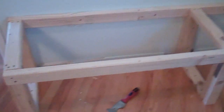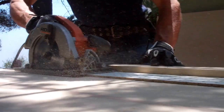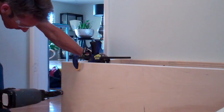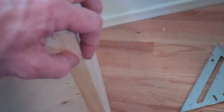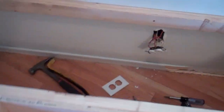Now I just have to cut the plywood skin that's going to go over it. I did this in the client's backyard, which is usually how I work. With the plywood cut, I got the nail gun out and nailed the plywood on. I've got these corners here that didn't all match up perfectly, so I just ripped pieces of nice one by four pine to glue and nail into the end — I knew I wasn't going to have a perfect corner, so that was my plan.